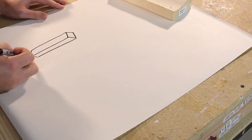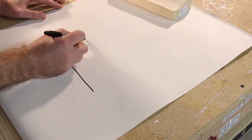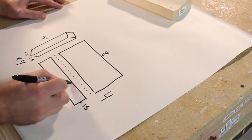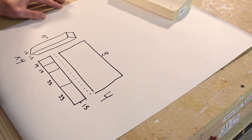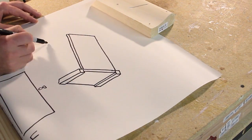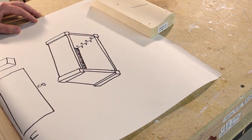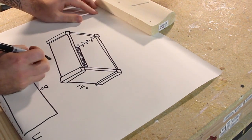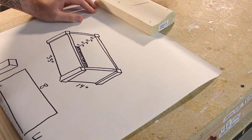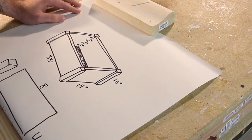To get started, you're going to want to cut up the corner supports. They're going to be made from 2x4s, 15 inches long, 1.5 inches on all sides, and you'll need 4 of them. Next you'll need a 4x8 sheet of cabinet grade 3/4 inch plywood. I had them cut off a 15 inch sliver along the 8 foot side, and then when I brought it home I cut up two 33 inch pieces and two 14 inch pieces — those will be the walls. The walls will be connected to the inside of the corner supports with wood glue and an alternating pocket hole pattern. The rest of the plywood you can use as both the bottom and the top. The top will have a 1.5 inch overhang as well as a routered edge. Once it's all put together you should have a 14 inch side, 15 inches tall, with a 33 inch front.